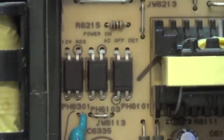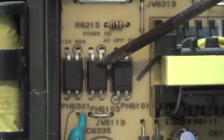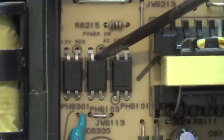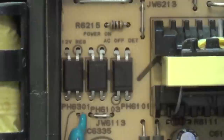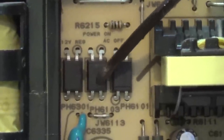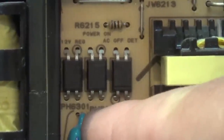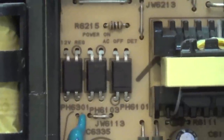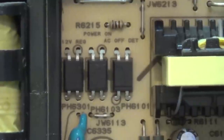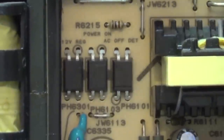There's a voltage placed across the diode side — I let the power to the TV shut off so I don't have to worry about sticking my fingers in there. We have about 1.6 to 1.7 volts across these two terminals, measured with respect to ground because this is on the cold side. What that does is it makes the LED part of this optocoupler start to shine internally — that's why it's called an opto-isolator or optocoupler. It optically isolates the hot side from the cold side. When the LED shines on the phototransistor, the phototransistor conducts — that's like closing a switch. This is what turns on the oscillator.